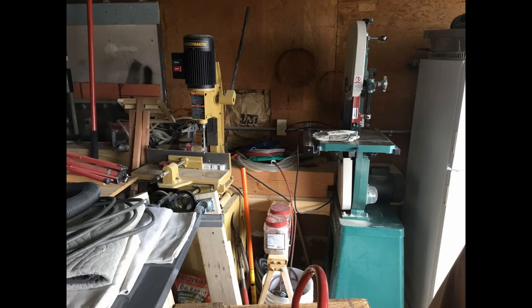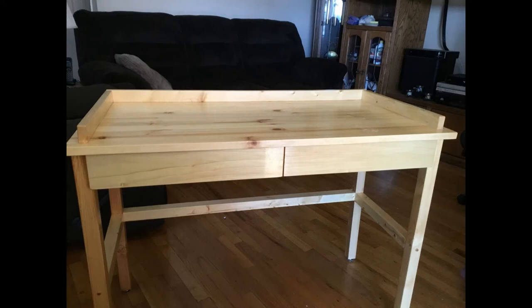Ramsey, for example, in his video, was showing the biscuit jointer and put two end pieces together, one by the butt joint at right angles, like you would make a frame. Well, you can't put force on that. But I worked in the studios many years ago, and that's one of the ways of very quickly making some kind of a frame or opening without exerting force on it. So it depends on the context of what you're using, what you're intending the structure to withstand. Other than that, the biscuit jointer is a really quick way of doing things.